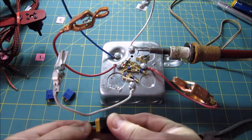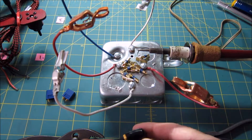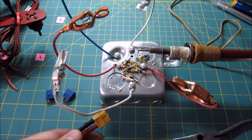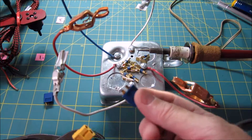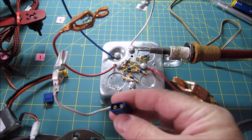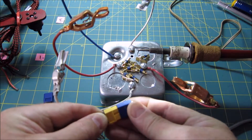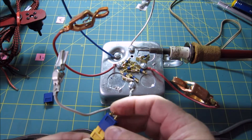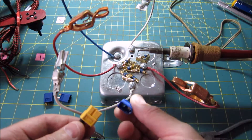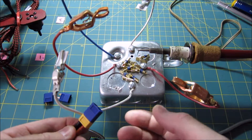A lot of people just do that — when you're done, use the battery up, throw this over the top and toss it in the bag. The ones that are not covered are good to go. The second way, which I think is a lot cheaper than buying $15 worth of these, is to just get some regular XT60 connectors. They come in pairs — the male and the female side. The male side is actually a perfect fit right over the top. The problem is the conductors stick out, so if they could be removed, you'd just have a regular connector cap without anything hot that could short out with other wires in a bag.